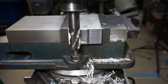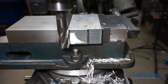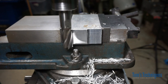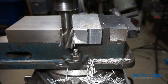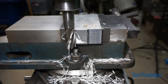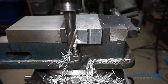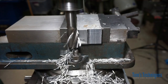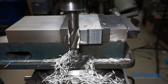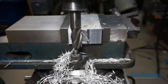Now let's talk about conventional milling. Going down to the other end at the same depth of cut, the difference is we're feeding in the other direction — feeding against the rotation of the cutter. Notice you don't see any of that jerkiness; it's not trying to pull the work into it. What it's trying to do is push the work away, but it can't because there's no backlash in that direction. When you're feeding conventionally, you're feeding correctly against the screw itself. This is what you should be doing on a light milling machine for heavy cuts — conventional milling.